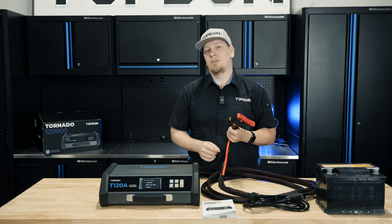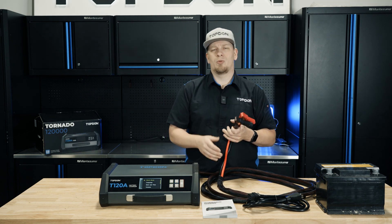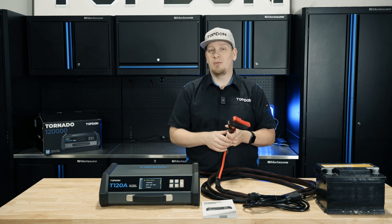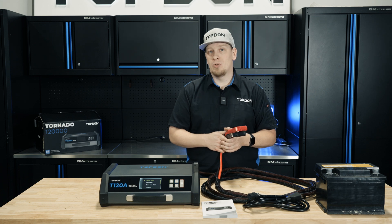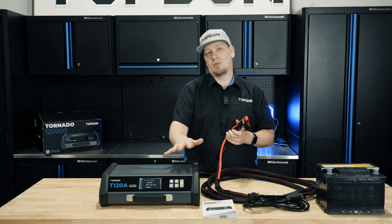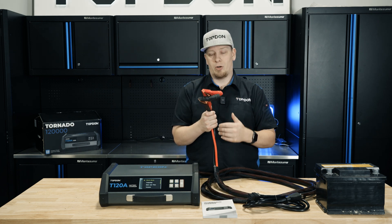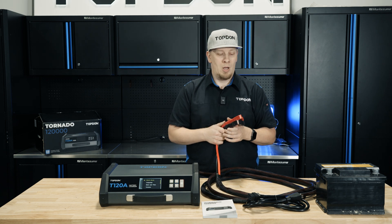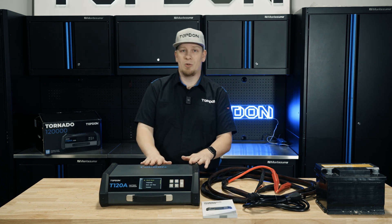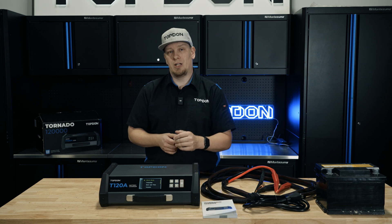With the unit we also have the option of a two-meter or a five-meter cord — roughly six and a half feet or 16 feet in U.S. terms. The cables have a setting in the unit itself that you need to change depending on whether you're using the shorter or the longer ones. The unit compensates for the voltage drop that normally occurs based on the length of the cord. The cords are interchangeable and you can use both with the same unit — all you have to do is make that setting change.